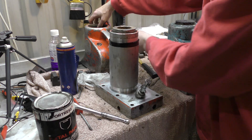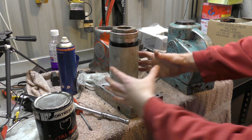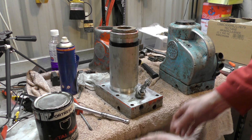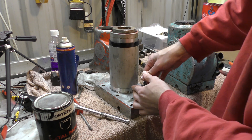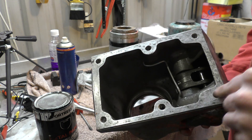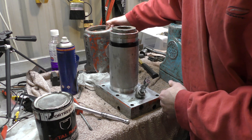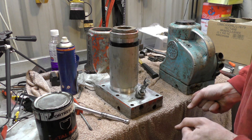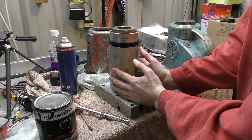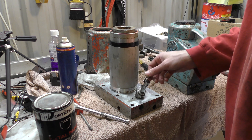Please bear in mind you need to undo — not the drain hole, this is the fill hole, there is a drain hole in the bottom — pour out all the excess oil, because this whole chamber fills with oil and it'll make a hell of a mess. I've got my shitty towel to absorb the mess. What I'm going to do is clean all this, then gasket seal round there and stick your top back on. It's supposed to have a fibre gasket, like a cardboard or paper gasket, but I'm not spending 90 plus VAT on ordering the seal kit. I don't really need it — silicon will do the job. It's not pressurised, this bit; it just keeps the oil in the oily bit and not spilling out on your floor. I'll put it back together and see if it works.